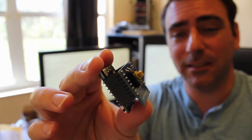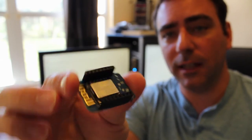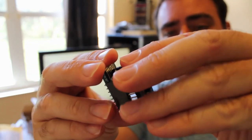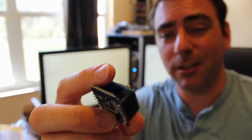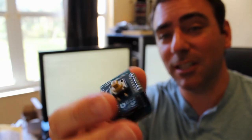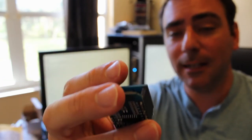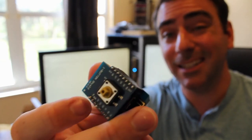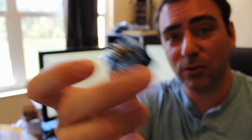The ESP8266 is a great little chip. These Wemos chips are nice, small, and cheap. Solder them together and you can slide in any of the modules you get for it. The hardest thing is just getting a power supply — a battery backup or hooking it to power in your house. You can have it receive signals or send signals, and here with the button press we're just sending basic HTTP requests, but then you can have the server do whatever you want.